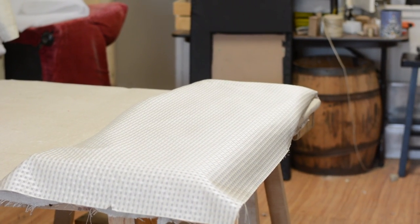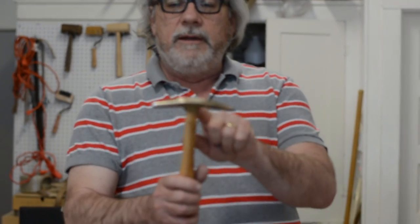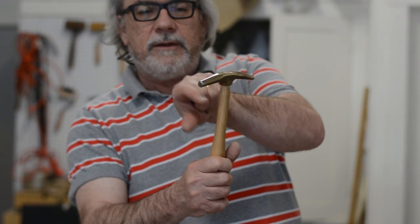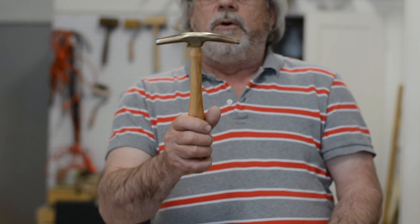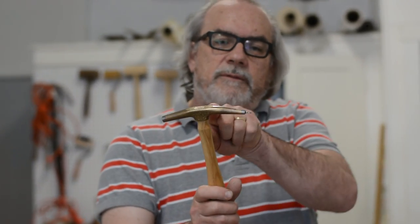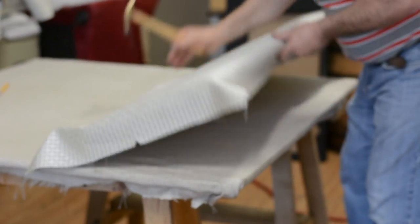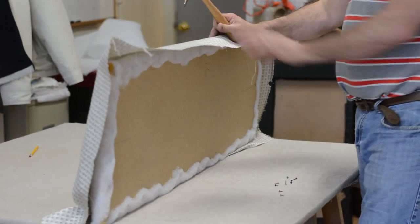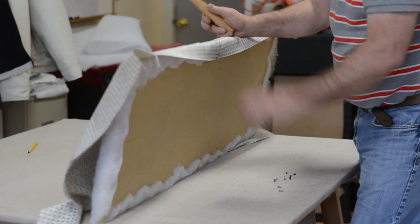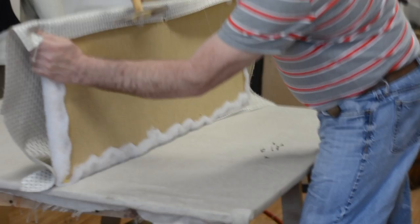I'm going to start pin tacking. The hammer we use is a magnetic hammer. The difference between this hammer and a claw hammer is it has a little bit of a dip on both the hammer end — the non-magnetic, bigger side — and the magnet side, which is the smaller one. You have to get used to adjusting your elbow to make up the difference of this dip. So let's go over to the piece and spread some pin tacks out so you can pick them up with the magnetic end of your hammer. I'm going to line up my notch to the center point and put a pin tack in there, then come all the way to the end and give it a little bit of a stretch — not overdoing it, because this is just the first stretching.